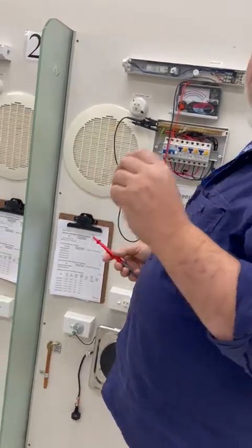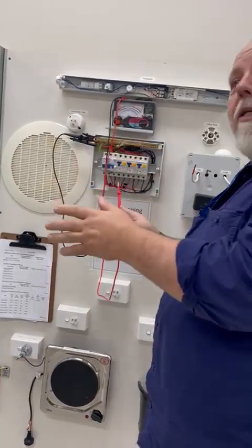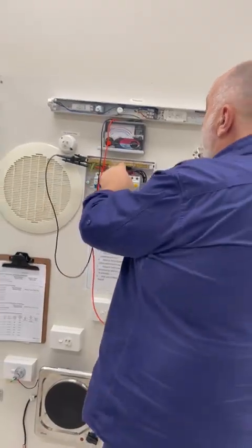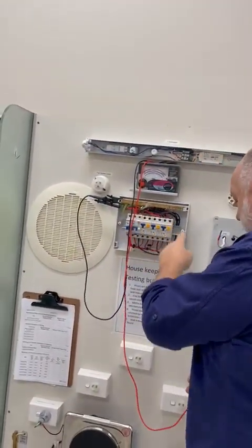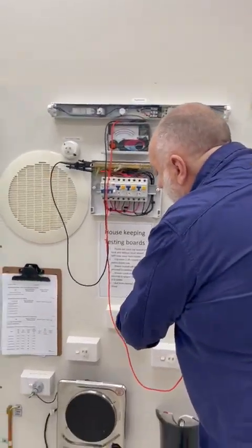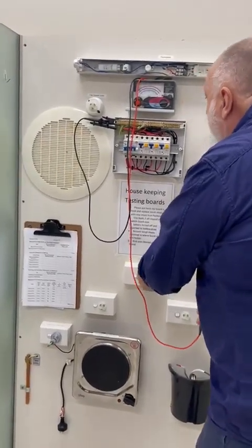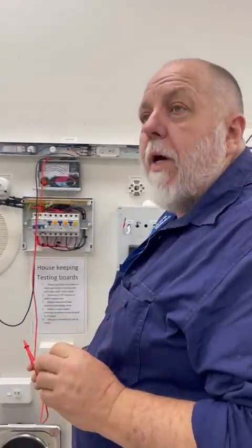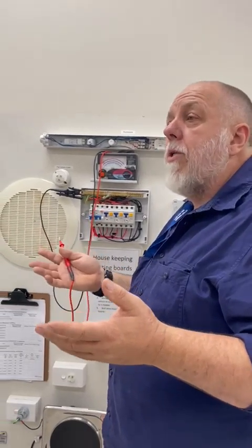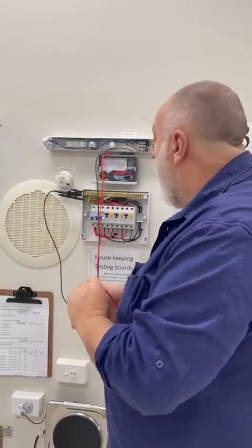From the earth bar to the fluorescent, to the earth points at all my sockets. What we do is add the resistance of the earth to the resistance of the active — go to table 8.2 to find the fault loop impedance. Fault loop impedance runs from the circuit breaker load side to the end of the power point. They've already given us the active value, so we measure the earth resistance back to the earth bar and add the two together. For example, if it adds up to 1.4 ohms and table 8.2 says the limit for that breaker is 1.6 ohms, it passes. More than 1.6 would be a fail.